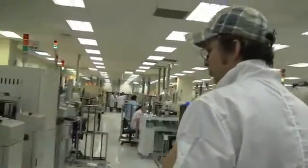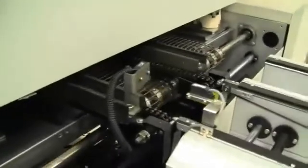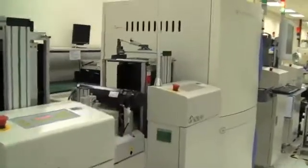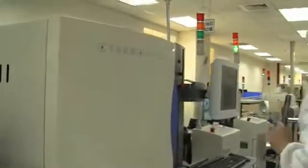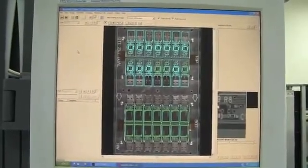After the oven, they come to a kind of in-between step — they get out, get rearranged, and repacked into new magazines to finally go into the so-called AOI, the automatic optical inspection. That's the final check for the USB sticks before they go into packaging, which happens on a different machine.